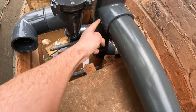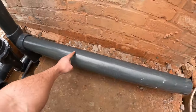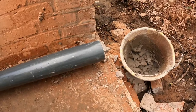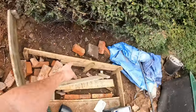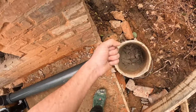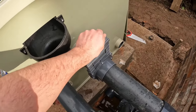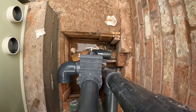There's a single pipe coming from the drain that goes into a T at the lowest point we could manage with this concrete pad. We've got a line running all the way down here and we're going to stick a slide valve on the end for purging. Both pipes tee in together and run down there, so you'll have one air to purge one drain and another air to purge the other. That helps keep sediment from settling in the bottom drains. You've got your two slide valves to isolate the filter if you ever need to — they're also closed when you purge.